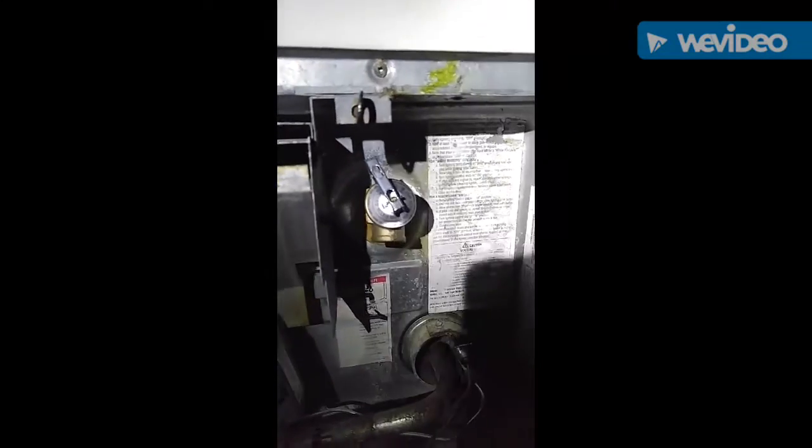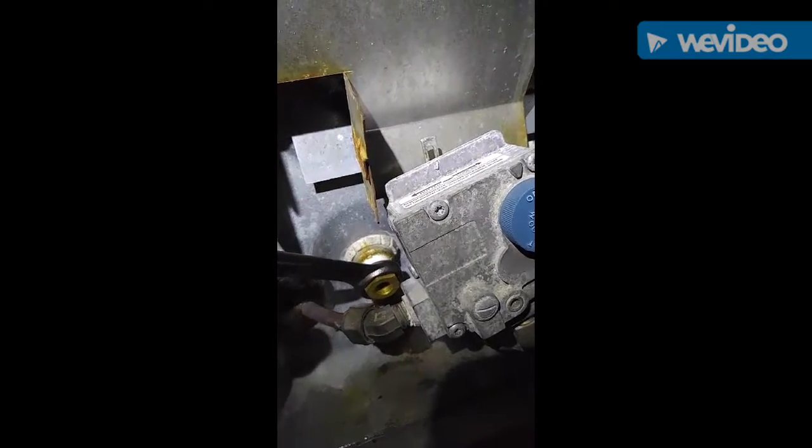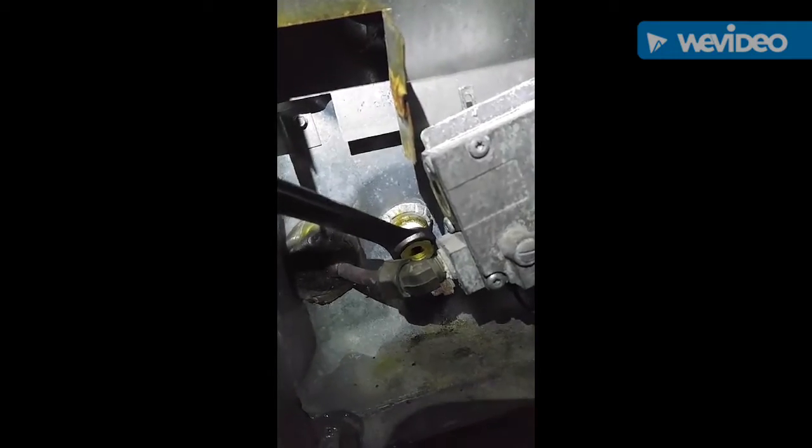I installed the new relief valve — that was painless, just a couple wraps of Teflon tape. I've got the smaller reducer installed, because the Atwood uses a 7/8ths thread and I've got a 22mm which is a 7/8ths. It would be a lot quicker if I used a ratchet wrench, but I don't have a ratchet wrench in 22. So I'm just doing like a quarter of a thread at a time to get this first reducer in — it's kind of tucked up in there and hard to get anything really on it.